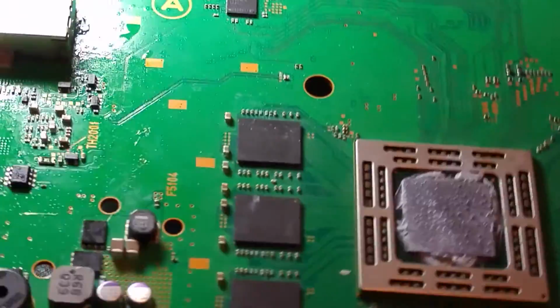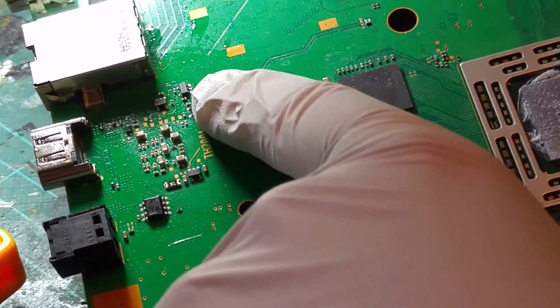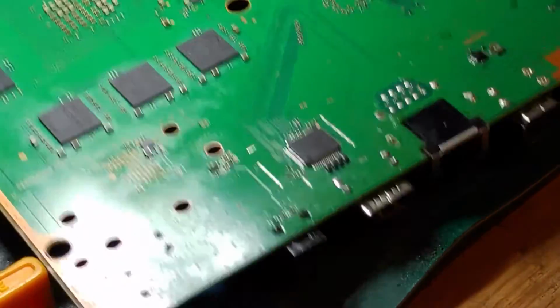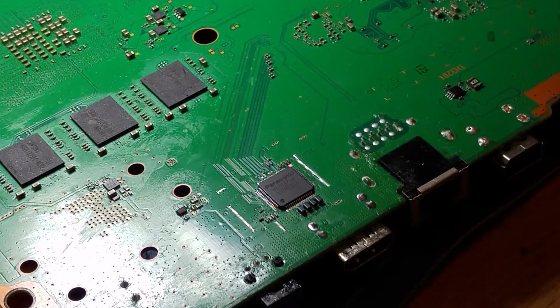That's not bad. They've tried replacing a couple of these other caps and things around here, and some of these little ICs that sometimes go open. Those haven't changed the situation at all. The encoder IC, as I say, they've changed, and there's no problem there. I've checked for shorts on this circuit, and there are no shorts present on the back of the port, no shorts here. Everything looks to have been done to a decent standard, which is nice.